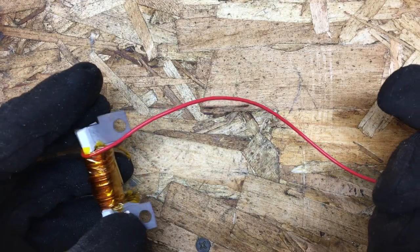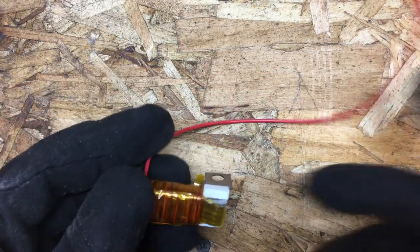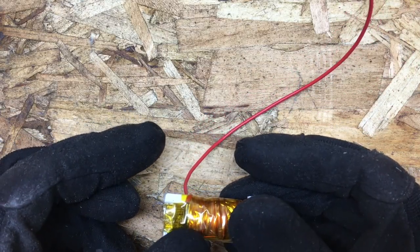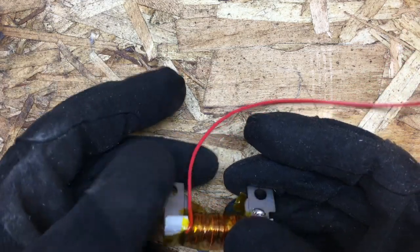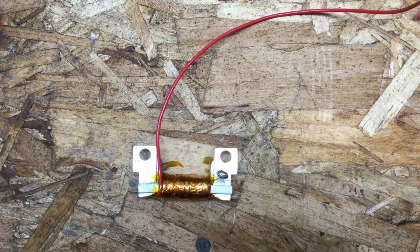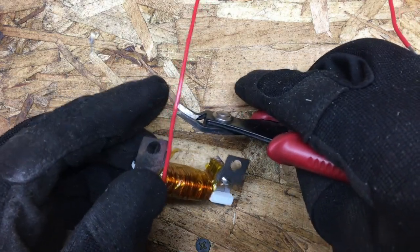The complaint online is that these wires can get hot. So what we're going to do is cut this pretty close to the coil. We're not going to unwrap the coil because then it's just like an unwound spring and just boinks everywhere. We're just going to take a little bit of insulation off and then put on a thicker copper wire. First things first, we're going to go ahead and cut off this wire here.